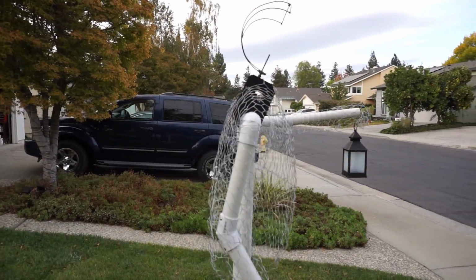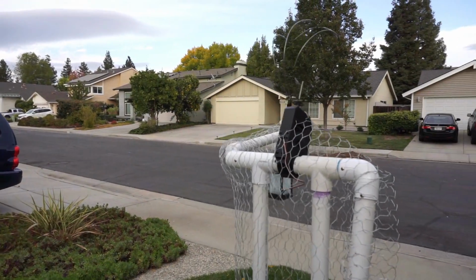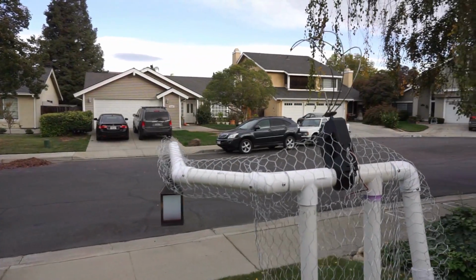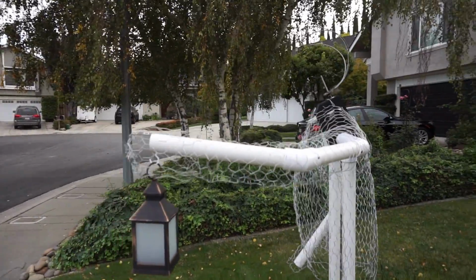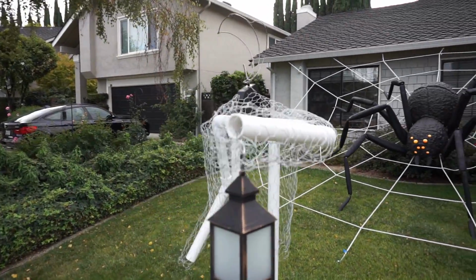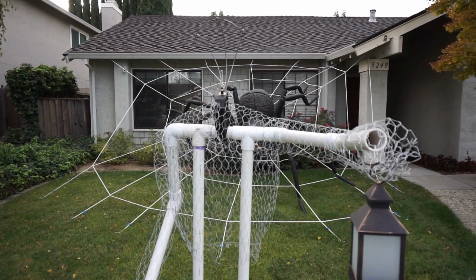The servo assembly is mounted at a slight angle to mimic human anatomy, and the head cage is attached. The head cage is made out of 1/8 inch steel rods that I bent by hand and formed to fit my own head, then welded to the fender washer. A hook is screwed in place at the end of the arm to hold the lantern. The gown and cape will cover the hand, so nothing fancy is needed here to replicate the hand.